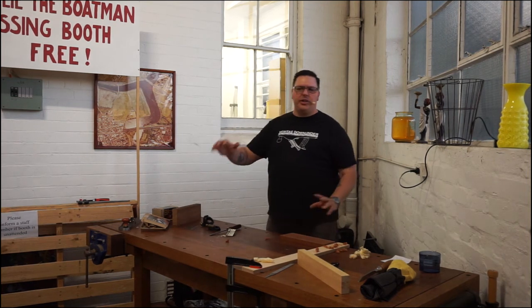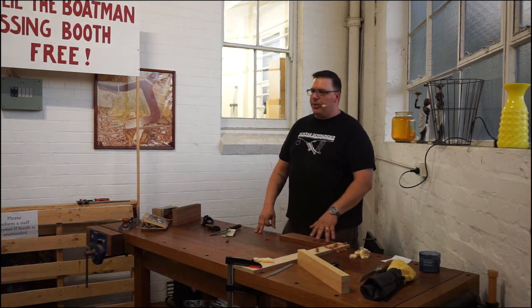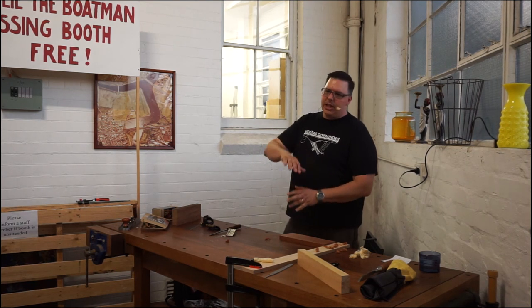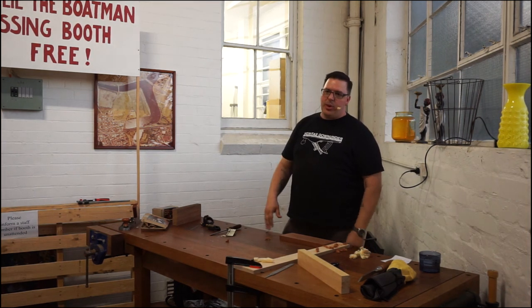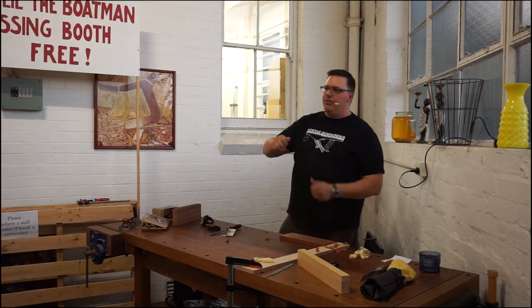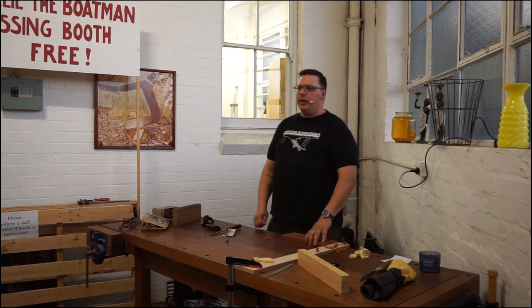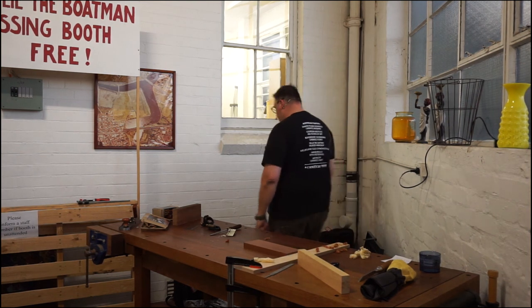You always work downhill in curves. On flat boards where you're going with or against the grain, it's not such a big deal. But if you're doing like a cabriol leg or something like that, you better observe that because you'll end up with a mess — it's more in-grain at that point. As you make those severe cuts on the knee, that bit that comes underneath and back out again — if you go uphill on that, you'll have a hot mess on your hands. And a lot of swearing. Which isn't completely a bad thing, because we have some wonderful Canadian whiskeys here.